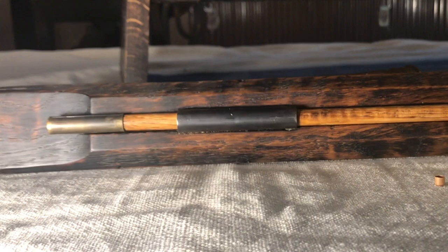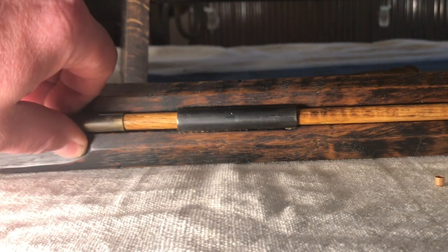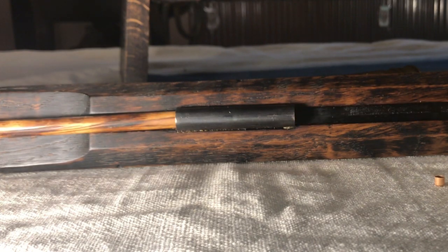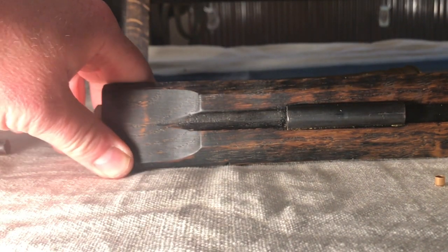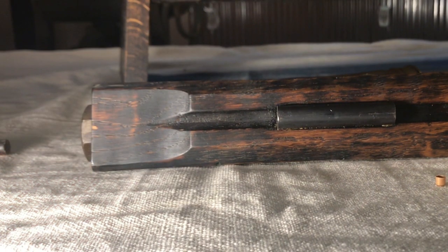My hands are pretty bad now and a lot of that little chisel work I don't do so well. I got a hickory ram rod there. That channel was a good challenge to drill, mainly because that channel's over four feet long. My drill was at the face of the barrel but the cutting edge was almost four feet away. I had to drill about a 14 inch hole in that stock, and I had to make a drill bit. I used an old style design, and that's in a video as well if you want to check it out in this playlist.